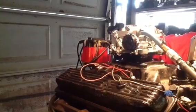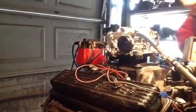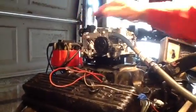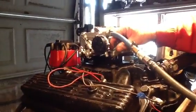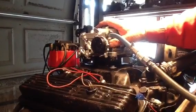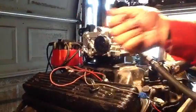This is one of the very rare ones that we've had in recent years with the starter switch. It works. When you start it and you step on the gas, it makes a complete circuit right through there and it starts it. And if it doesn't start the first time, of course, it floods the motor like crazy. I remember my neighbor had a brand new one like that in the wintertime — you didn't know whether it was flooded or not. That was a crappy setup, so we used to unhook those things and put a push button on them.